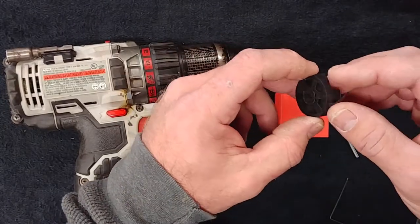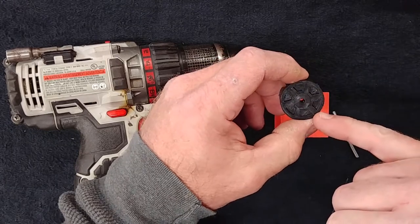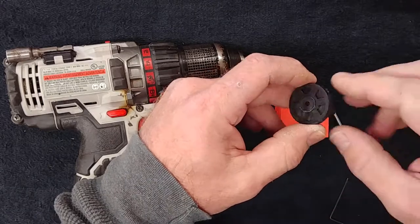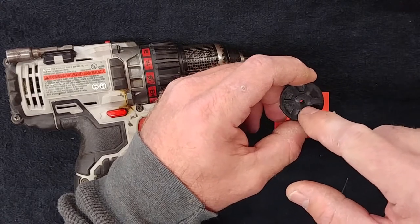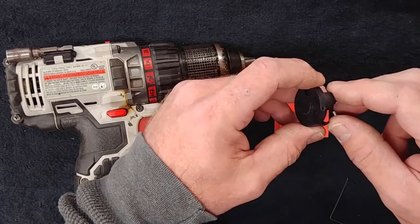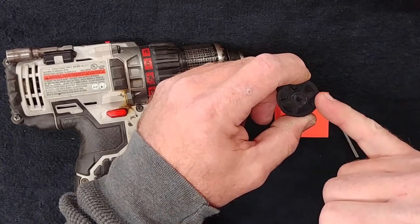On here we have the new large pump impeller. On the bottom side of it you'll see that it has spokes with pockets next to them, and the set screw passes through one of the spokes. Inside this raised area is where the brass insert or metal insert sits, and the set screw is approximately a quarter of an inch in length.